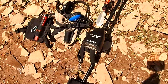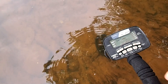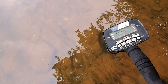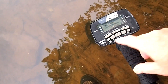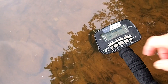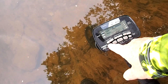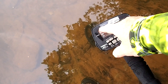Now I'll show you how to set up the AT Pro for the type of water hunting I do. The first thing you want to do is make sure you put your coil in the water — it's really important. If you don't do that, it kind of jacks up the ground balancing. Mine's already in the water as you can see. All you do is hold in the mode button, which is also the power button, and your power comes on. I like hunting in Pro Zero mode. To change to that, you hit the mode button and cycle through the standard programs until you get to Pro Mode, then you can select Zero. Now you're in Pro Zero.